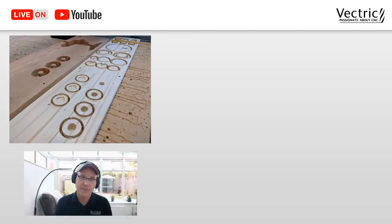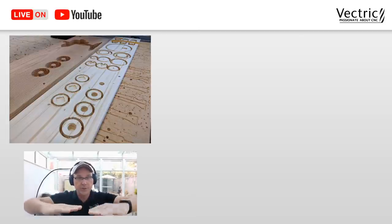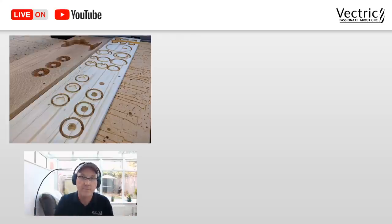As you can see, it looks a little funny up there. My tabs were a bit thin. They managed to hold together while I was cutting out the actual armature, which was great, but then they got a little loose and they wouldn't be strong enough for me to go back in and pocket out those holes again, no matter what I did. So I used some double-sided tape, stuck it down on top of that, and that held them in there super secure. I was really confident they weren't going to move, and they didn't move. Well, I went back and made those holes a bit bigger. So there you go. That's my first two mistakes I made.